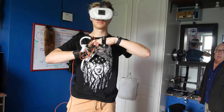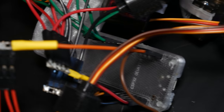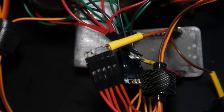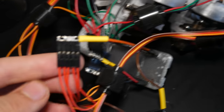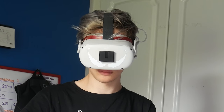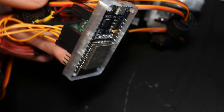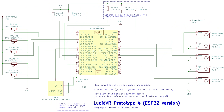Congratulations — build process done. Now it's time to connect everything. Put DuPont connectors at the end of all your wires so it's much easier to connect to the ESP32. I even replaced the triple DuPont connector at the end of the servos with single ones and recommend you do that as well. I also soldered up a one-to-five DuPont connector extension — it's janky, but it allows connecting all five DuPont connectors to one. Something incredibly important: all your potentiometers need to be connected to the 3.3V and ground pins, while all your servos need to be connected to the 5V and ground pins. Then follow the provided datasheet for exactly how everything gets connected.